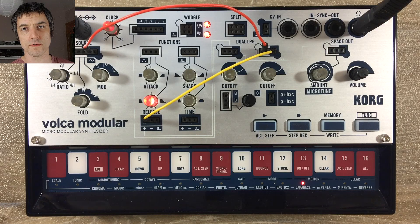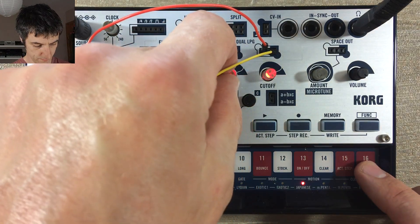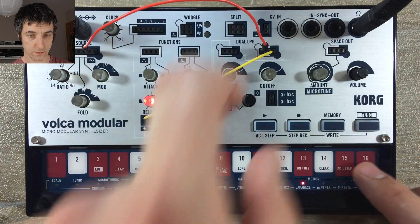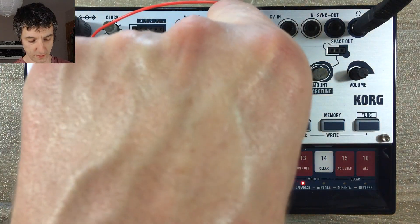What's happening is that they're at a reasonable level individually, but once we add them both together, the voltage is just a little bit too much for the output stage, and it's distorting. We can back off the cut-offs a little bit until the distortion goes away, but then we're completely changing the tone of our sound.